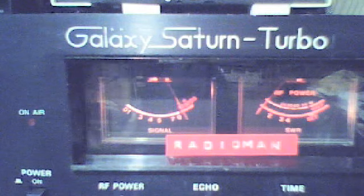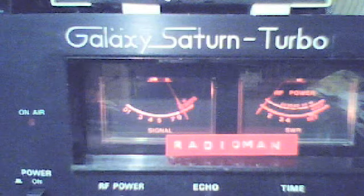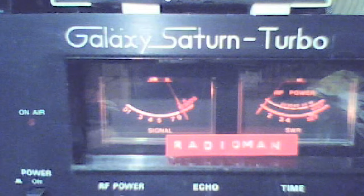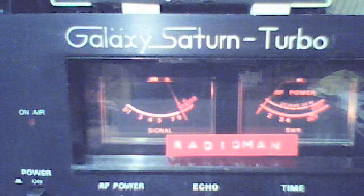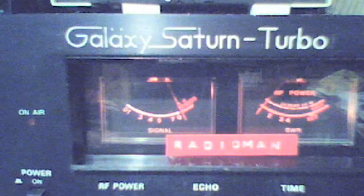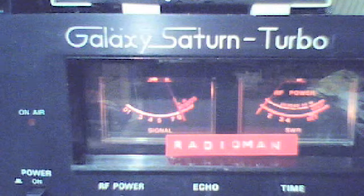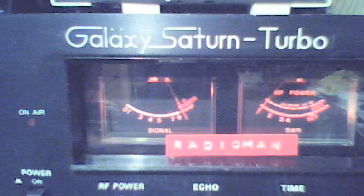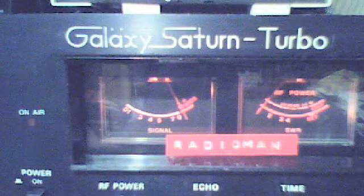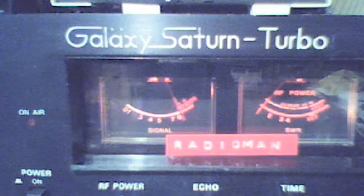The only thing that I'm hearing is that the audio sounds like it'll be more conducive for sideband in that 3 kc type of bandwidth where the bass frequencies will really come in. On AM, you need more high-end versus more low-end. If you can lower your low-frequency content and bring up the highs, or sometimes just bringing down the lows will actually allow the high-frequency content to come up to balance it out. That's the only thing that I'm hearing.